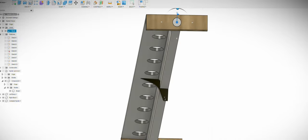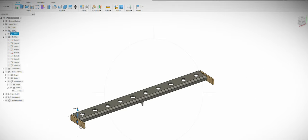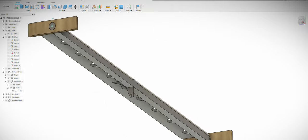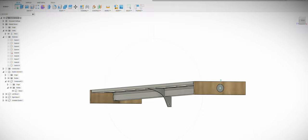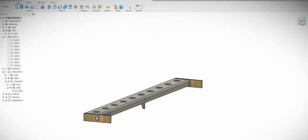The design is currently two solid components: the main spoiler with the dowel built in — this will be 3D printed — and then the control horn, which will slide in and be glued in place in a slot cut here. These blocks represent the end ribs at either end of the 300mm gap. There are more ribs in between, but I can notch those out to give the pivot block clearance — the rest of the ribs will provide support.